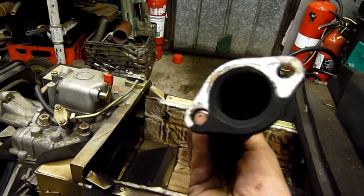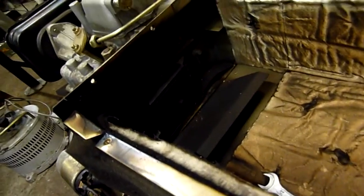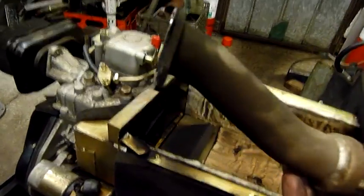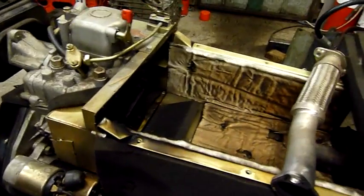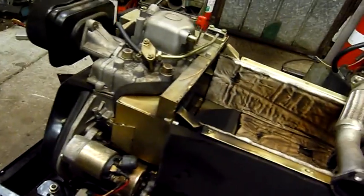After a bit of clean-up and inspection, I found a nasty problem. The exhaust gasket's blown out and one of the nuts is completely missing, so it would have been noisy as hell when running — just blowing exhaust out through the side of the manifold. I'm going to leave it as-is and try to start it with the exhaust open. It'll be loud as hell anyway, but not much worse than what it was.